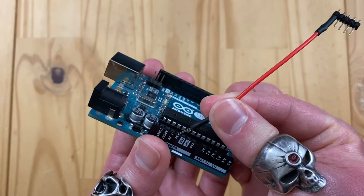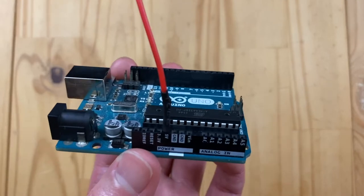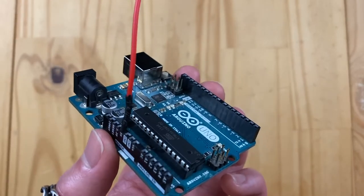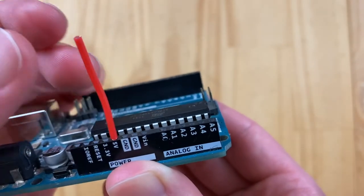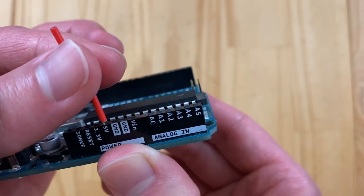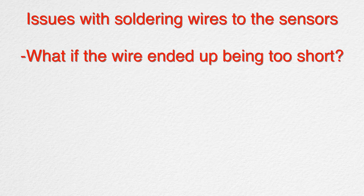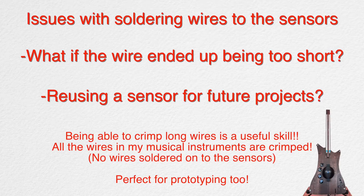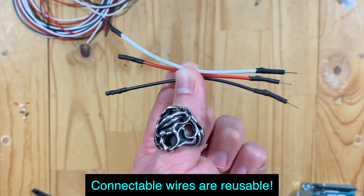The plug pin of the wire can be connected to the Arduino. We could solder the wires directly to the knob and connect the strands of the wire to the Arduino, but the issue is that the strands are too flimsy and can come off too easily. And if you solder a wire to the sensor, that's a bit too much of a commitment. What if the wire ended up being too short for the project? Then we have to unsolder, which is time consuming. By making this type of wire, we'll make our lives much easier.